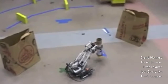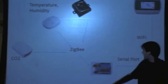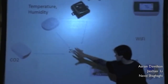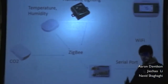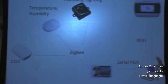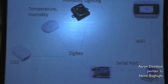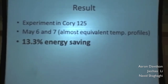There you go. It's the first time using it. That's cool. And here's the design. As you can see, we have the Arduino. We have a Zigbee network. We have our three sensor boxes that are all talking and coming in through one channel. There's some software stuff I'll talk about soon. On this side, we have a Wi-Fi network — the Arduino talking to a computer and then that computer talking to the thermostat. There's a reason we didn't go directly, and we'll talk about that further. We show that we can save 13% of energy compared with the previous control equipment.